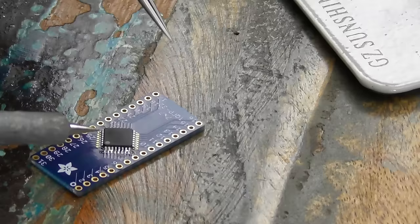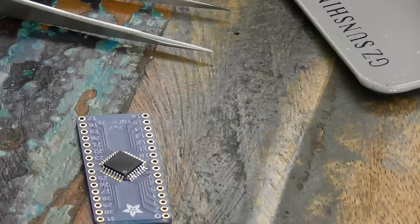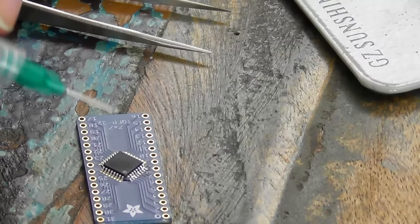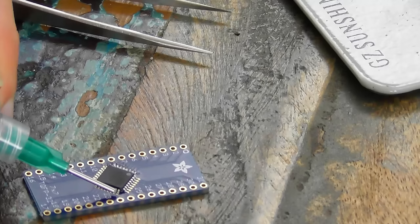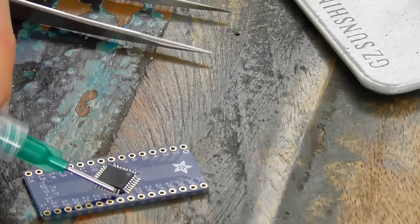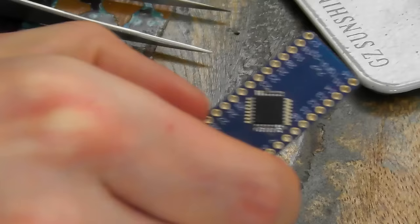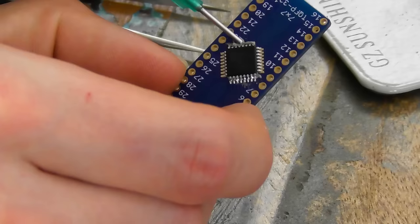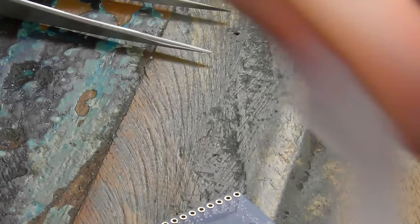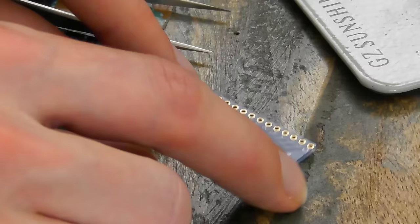Sometimes you can get rid of a bridge by just trying again, but other times you'll need a little bit of de-solder braid to get that excess solder out. In this case there's just too much solder — did we bring any de-solder braid? Let's do another edge. It should be a bit easier now because we can apply the paste directly to the fixed component — nothing is flapping in the breeze. Make sure you've got a flux pen; it makes life a lot easier. Also have some solder wick — a braid you can use to remove excess solder.